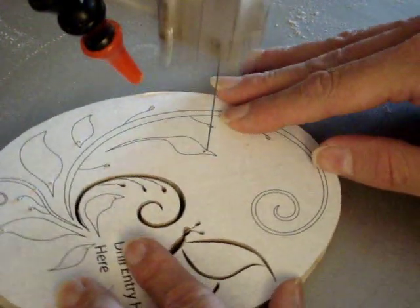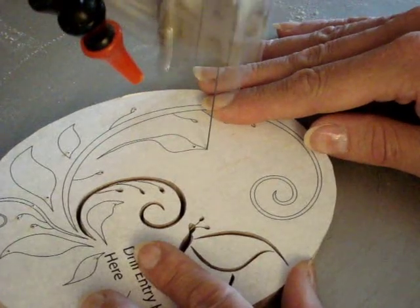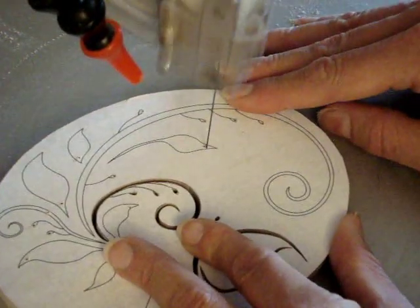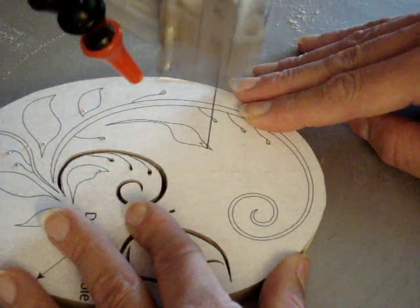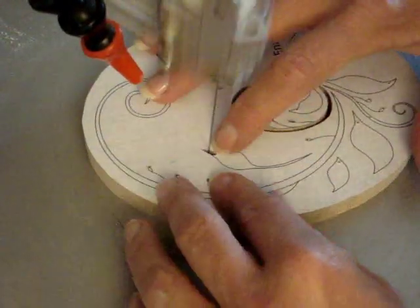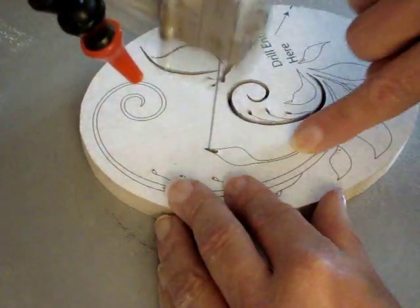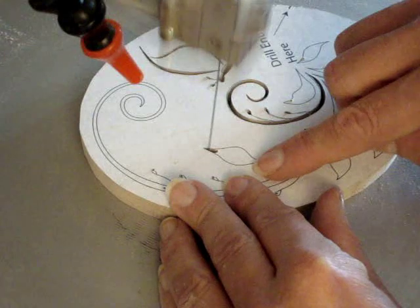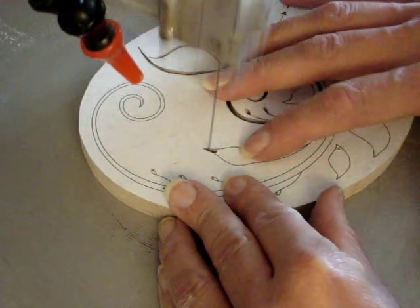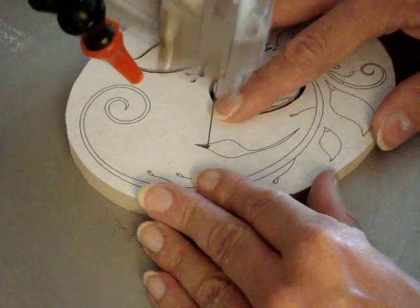We're going to do this like any corner. Where you take out a little triangle. Now I have a choice of coming around that way or that way. I'm going to choose a straighter edge because I'm going to have to back the blade up. So I want to back up the path with the least amount of curves. It just makes it easier.